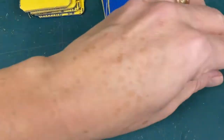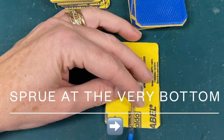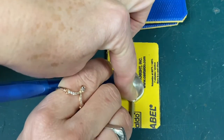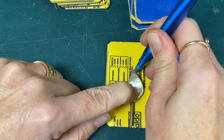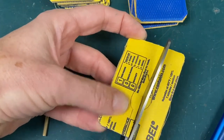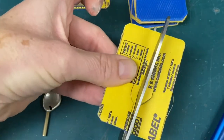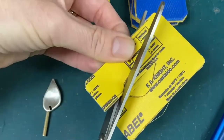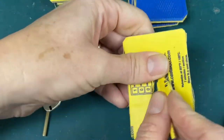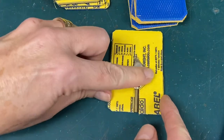Take your center strip and prepare to cut a bed or an opening for your object. If your object is very thin you may not have to do that, but if your object is thicker than a millimeter and a half you need to cut an opening to contour your piece as well as the brass sprue. Take your pen, draw onto the fabric side, and then cut roughly your shape. Cutting with scissors is fine; an exacto knife works too but be careful. You don't want to cut too big — you want the piece to be snug in the rubber.